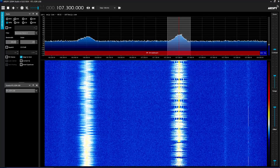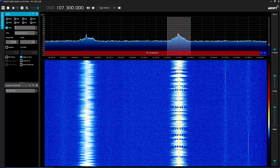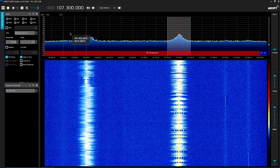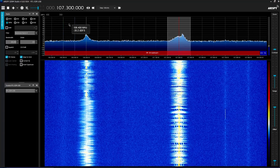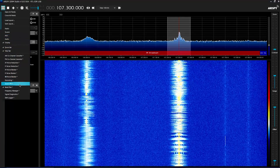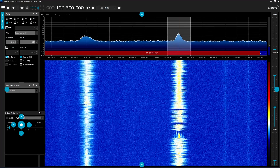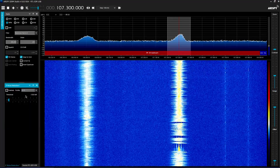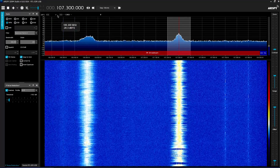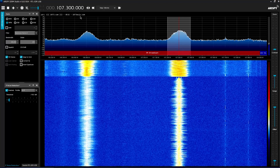You're going to have to go through the SDR Sharp forums if you want to figure out what all these little settings do. We're going to be using Shift for our next tutorial, which will be to use an upconverter. You can get some data from the FM stations — there's a lot of things you can do. For example, you can have co-channelers and all sorts of options. There's also one for favorites. You can turn on noise reduction if you don't want it sounding so bad, like if you have static. We slightly increase the gain — there we go, that's the sweet spot. We've got data now.